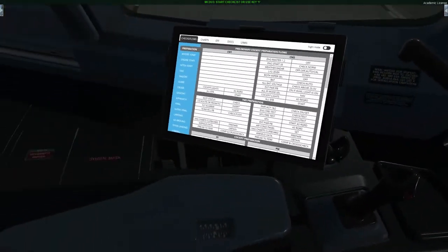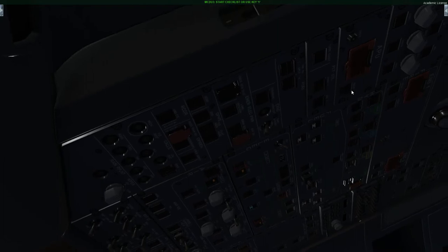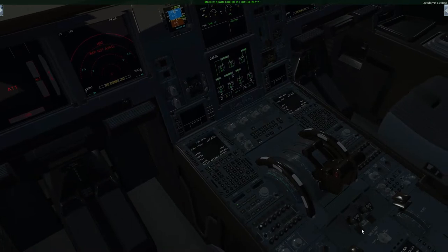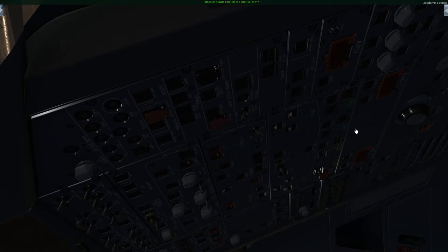Having completed that we can now perform a check on the oxygen, and I'll also go ahead and complete the fire check. When we do the fire check you should get the squib and discharge lights on both agents and the fire push buttons — this goes for both the APU and the engines — and we should also get the relevant ECAM actions. On the fire check for the engines these should light up with fire. As you can see we have the fire push button, squib and discharge lights, and ECAM actions — that's totally fine. Same thing with the engine — we have engine one fire and the fire lights — all well and good.